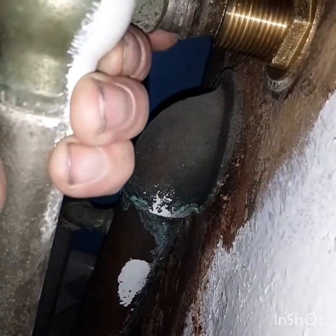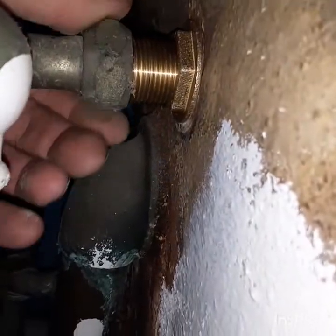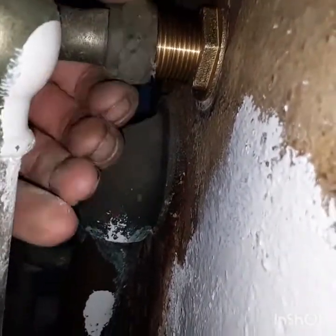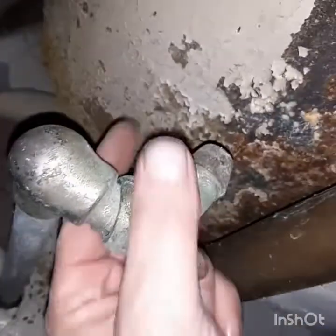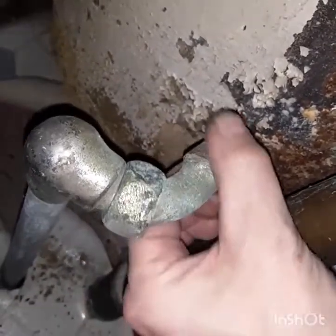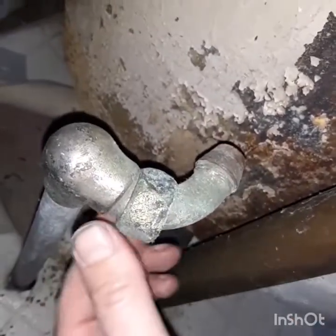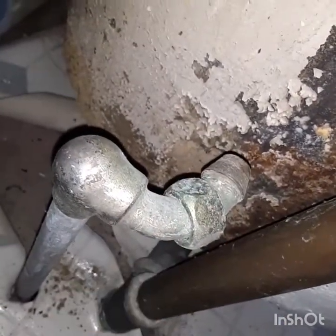These pipe connections, on the other hand, you want to crank on there. You line it up, plop it in, thread it on, go to town — you can just crank on those. Because it's brass, it's gonna form-fit to it. Even the old stuff's brass — it'll squeeze in there and fit the form. If you get a leak, crank a little harder, that's all.